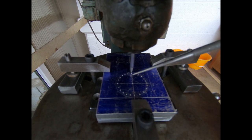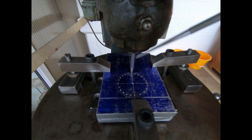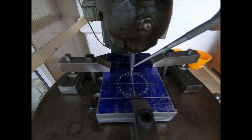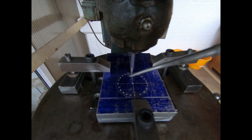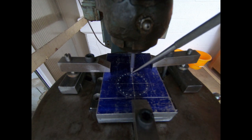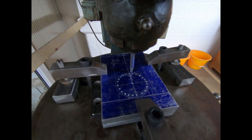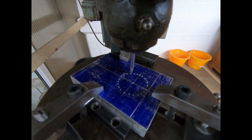At the jig borer, I ensured the workpiece was on center, going down onto the center of the table and making sure that was correct. Then I had the center pop in line and clamped it all up with my three clamps. I've left a gap underneath so I don't drill through my table, locked the bed so it can't move back and forward, then indexed across to where I need to be. By turning the table, we keep that same diameter.